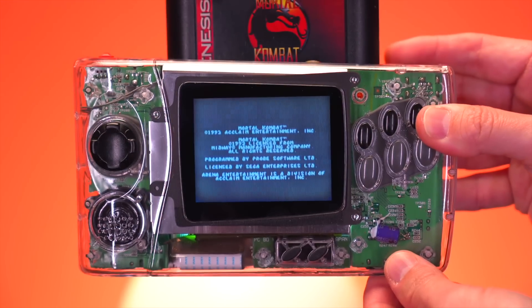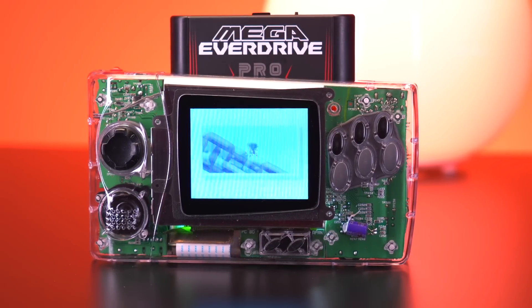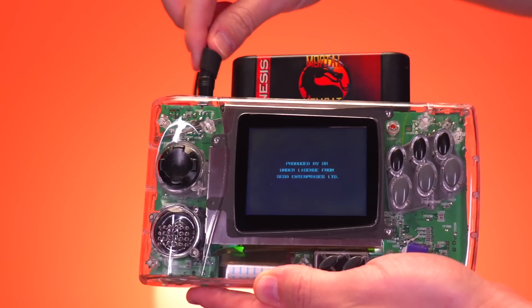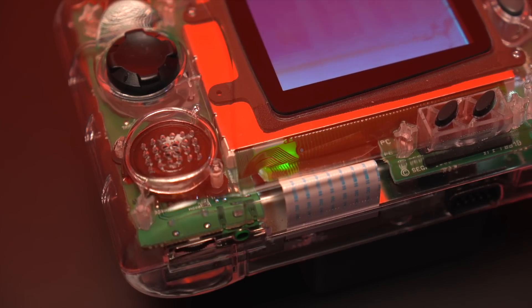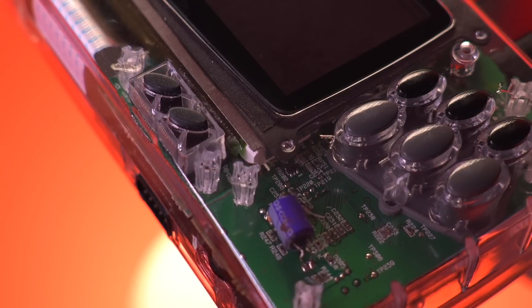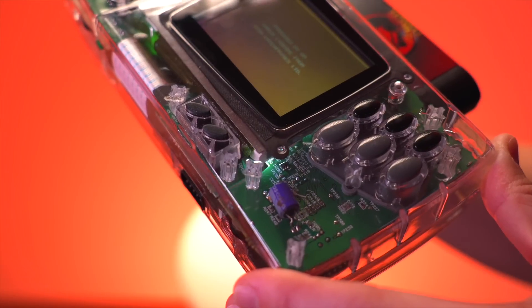I was able to address the screen issue which is now working perfectly — or as perfectly as a Nomad screen can look, since it still looks pretty washed out, but that's par for the course on these older LCDs. By simply reflowing the solder on the power port, I was able to fix that as well. So effectively, this completely mangled Nomad has been given a new lease on life. The shell, which is something we literally didn't have an option for, is now looking good as new — and honestly, I think it looks better than new. The translucent shell looks fantastic. I even like the small amount of light bleed coming from the LCD, since it sort of illuminates the circuit board inside — a sort of unintended perk.